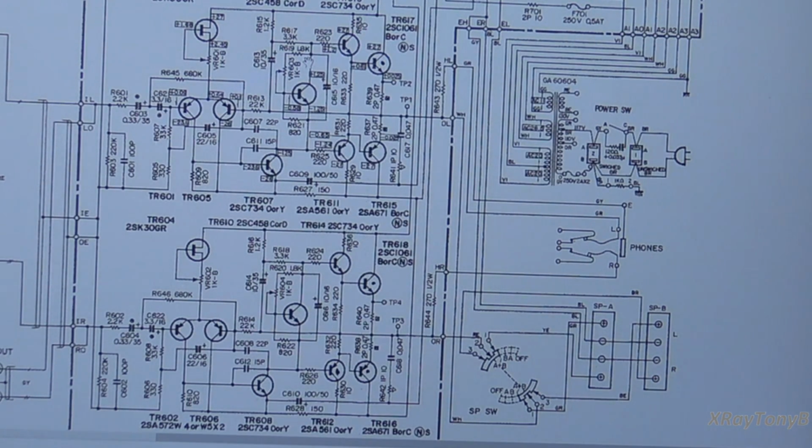But being that this only happened one time, and we can't get it to repeat itself, and those capacitors are warm to the touch, my guess is that we had capacitors reforming, and that's what caused that fuse to open up. But we're going to keep testing it for a while, and if anything changes, I'll come back and let you know.